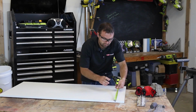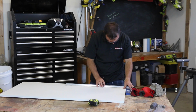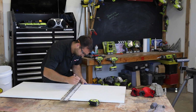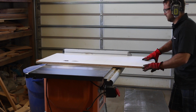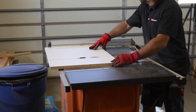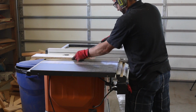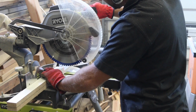The concrete top for this project is going to be a 20 by 20 inch square that is 1 inch thick. We'll use the reverse cast technique, which will make it easy to get a smooth and level surface. Use a table saw to cut the side strips and base of the mold. The strip width will determine the thickness of the concrete. Since we want an inch thick concrete slab, we'll cut the strips to 1 3/4 inches wide. The extra 3/4 of an inch will compensate for the 3/4 inch base of the mold the strips are attached to.